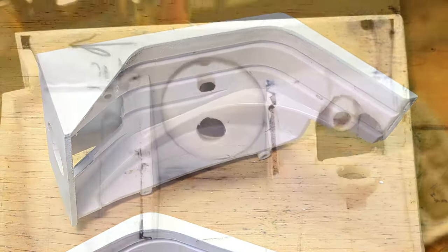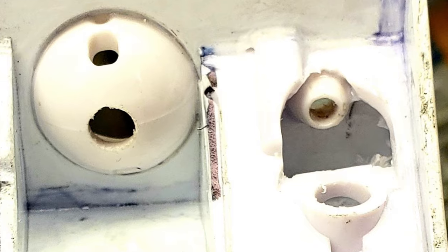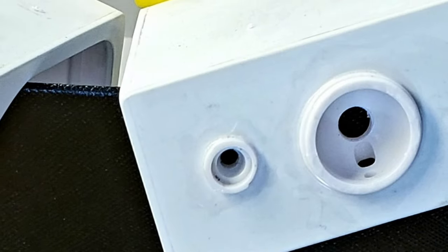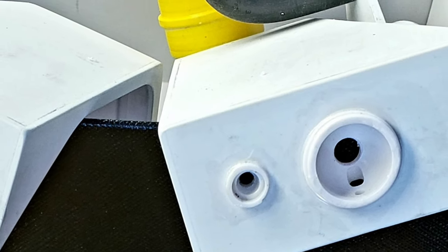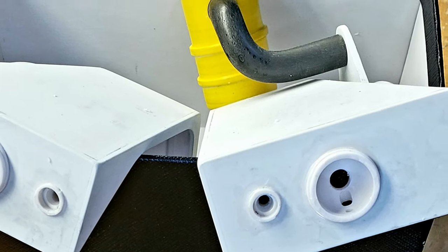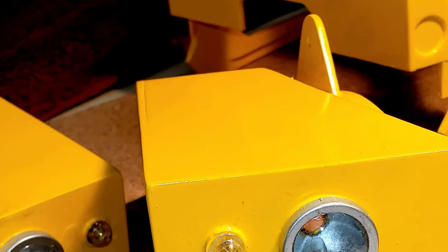An opening was then cut in each fender with a Dremel tool to allow for the LED turn signal bulb to be installed. Here are the two modified fenders shown unpainted with the air filter, whose fabrication will be discussed next, installed to the right fender. Note that on this painted fender, an 80/1000ths polystyrene tab was also installed on the right fender to land the bent nylon air filter ducting tube.